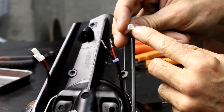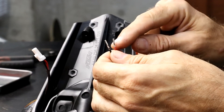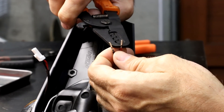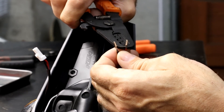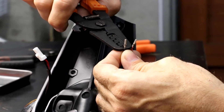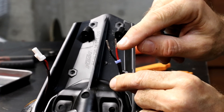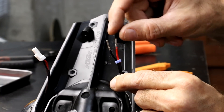The connector body where the contacts fit in has a very tight tolerance. So if you have any parts of the connector sticking out, it won't fit in easily. What I like to do to ensure it goes smoothly is to use the end of the crimp tool and make sure there's nothing sticking out — just press down lightly on both of the connectors, and then typically they slide in reasonably easily. If you're using thicker wire or thicker insulation and it sticks out further than the connector, it won't go in easily, so you'll need to trim the insulation in that case.